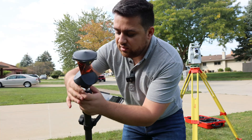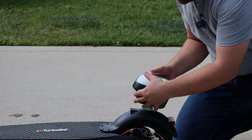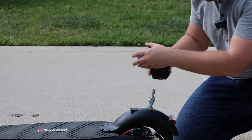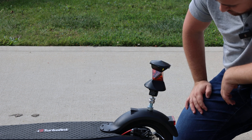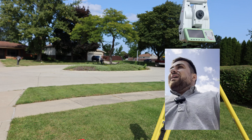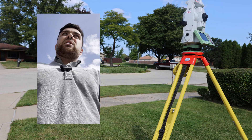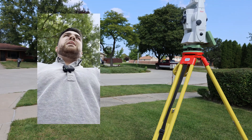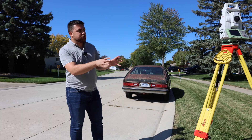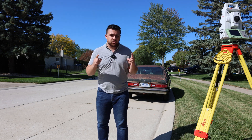This gave me the idea: what if I put the Leica 360 prism on the back of the scooter? I remove the GNSS receiver, attach a converter, and mount the prism on the back. Now I can ride the scooter while the total station tracks my position. As long as I maintain visual line of sight between the total station and the prism, I can do this experiment without worrying about satellite visibility or RTK issues — just relative distance from the scooter to the total station. We have the total station running on Leica Captivate and Pix4D Catch on the iPhone, ready to collect data.